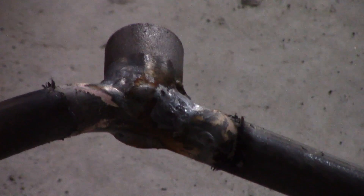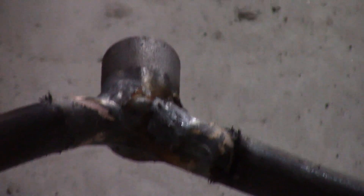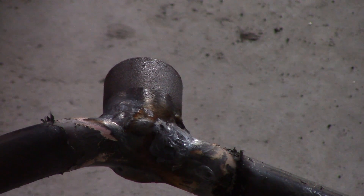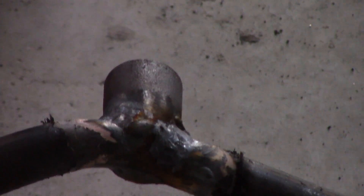When I was welding, even though I drained the tube pretty well first, there were copious amounts of smoke coming out of there and I actually heard a bit of a fire going on inside the tube. So I'm guessing there's enough oil there to cause issues, and I'm expecting there to be a lot of oil soot in that tube which I want to get out before I put it back on. First effort would be to pour a bit of acetone down there to loosen it up, then drag a rag through on the end of a piece of fishing line to make sure I get all that rubbish out — I don't want it going back into my hydraulic reservoir.